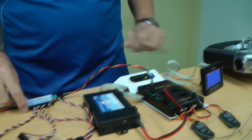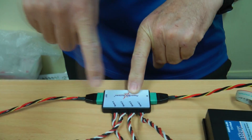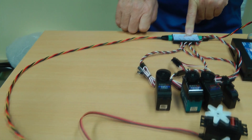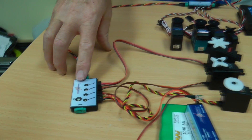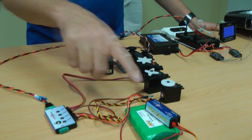If you have a look here, we have leads going into this little junction box which is taking care of four servos, and then we can branch off to another junction box. This one is for taking care of servos that are not SBUS or XBUS compatible — just your standard analog or digital style servos, and even your kill switch.